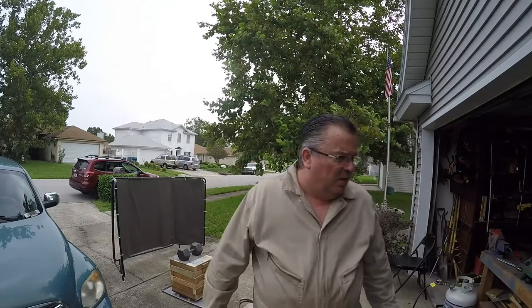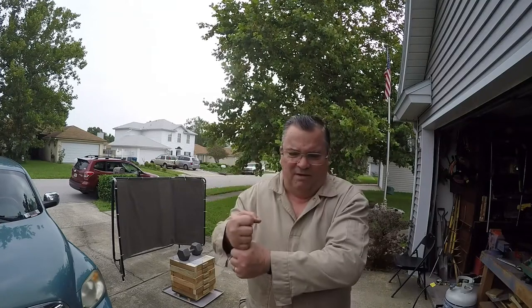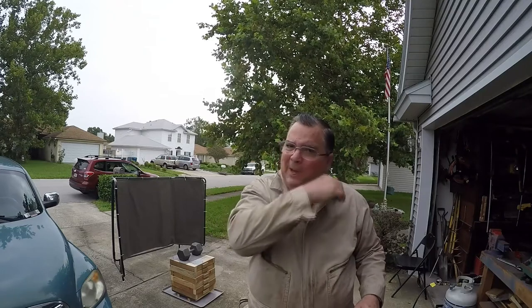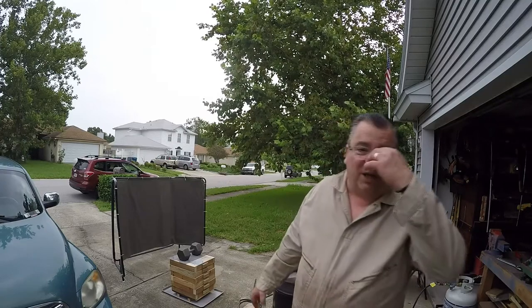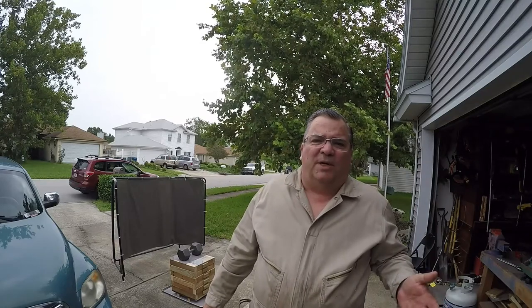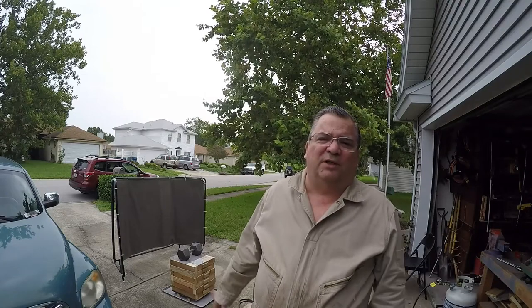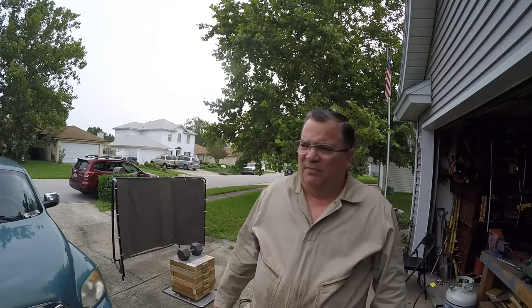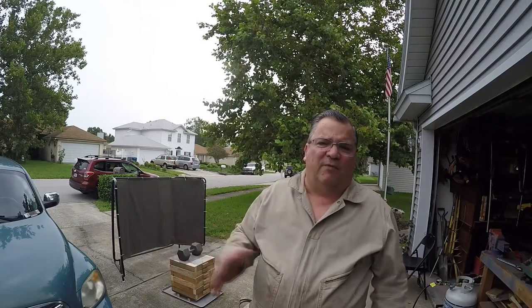In the past, what I would do is I would take a pair of tongs, grip the edge of the steel crucible, lift it out of the furnace, set it on that fire brick, which, by the way, never set it on the ground, because as hot as your crucible is going to be, you just don't want it to be draining any kind of heat away. Put it on a fire brick. The fire brick is designed to slow the process of heat transference. So you want to maintain as much heat as you possibly can from the furnace to the mold, so that none of your stuff freezes up before it's fully poured.